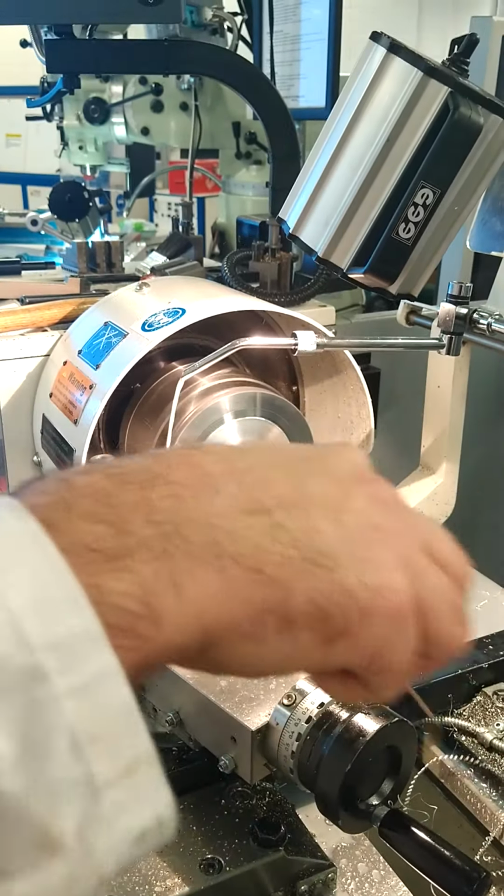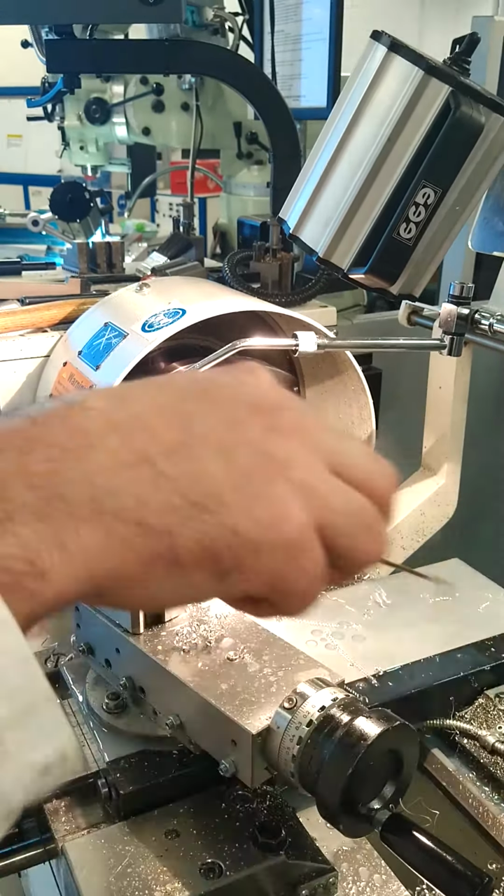And always clearing away and watching while machining using automatic feed. So never at any stage leave the machine unattended. Always stay with your machine, making sure you're watching what you're doing, and concentrating on what you're at. So the coolant is flying onto the tool and not onto the work, therefore it's not being splashed around. And we're getting an excellent finish on our part. That's what I call a continuous chip coming off there now.